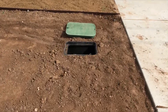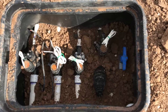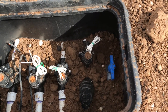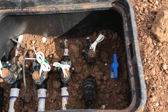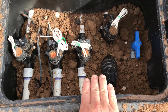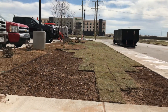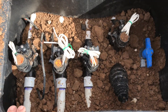If you're going to manifold these valves, let me get down here in this valve box so you can see what we've got. We've got our three grass zones, and I've got a shut-off valve before the valves so that if something happens, I can shut the water off there — makes it real easy. And I've got a drip zone there too. Looking at these valves, I've got them installed in the order that the zones are split out here in this grass section.